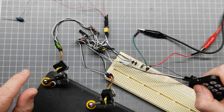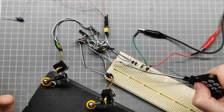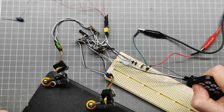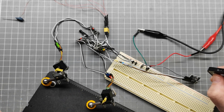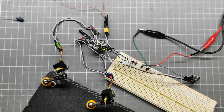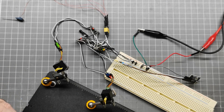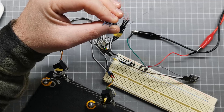When I'm activating these two stepper motors, the current drawn is substantially more — it goes from 0.02 amps up to about 0.9 amps, so nearly one amp. As you can imagine, if these are constantly getting that sort of current, they get pretty hot to the touch. I'm glad I finally sorted out the sleep function. It means I might have to redo the rear of the ship, since I already glued everything in place — which was stupid — but I've learned my lesson.